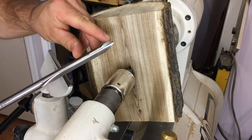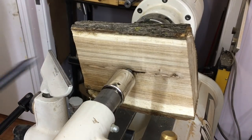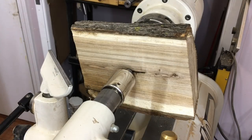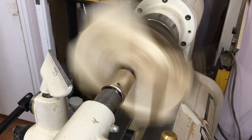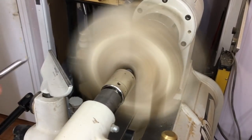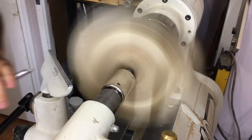We're ready to start turning. I'm going to start out with the swept back grind so I can use this really long wing to do some heavy roughing cuts, and then I'll switch over to the 40-40 grind. A viewer suggested I compare these two tools to show their different uses and that video will be coming, but for now we're just going to do a nice little rough-turning video. We'll start the lathe at about 1,000 RPM because it's a little out of balance still. Tool rest is set at 45 degrees to the piece.